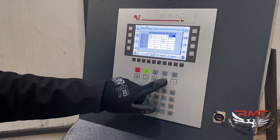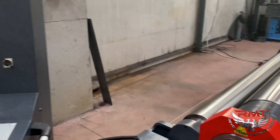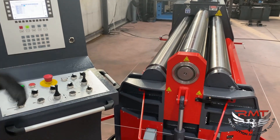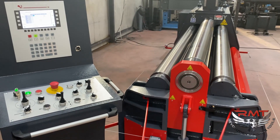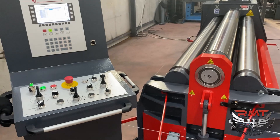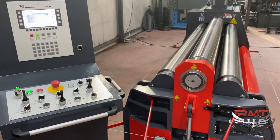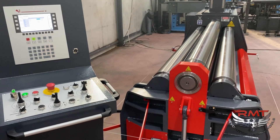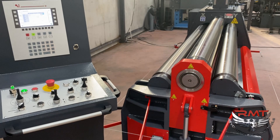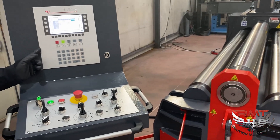When you finish your program, you can jump to the automatic page, which is the playback page. When I start the program, the machine does all the steps — going to reference positions at the first step, rotating the rolls 20 inches, then the left roller up, right roller up, and rotation again. This control unit also calculates a bending program automatically.